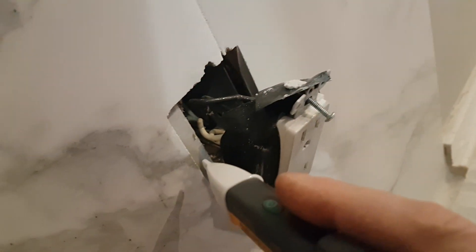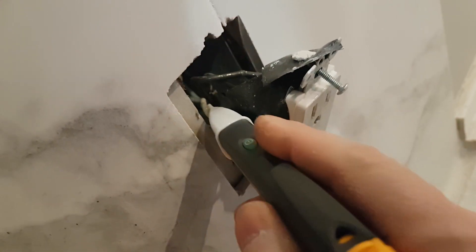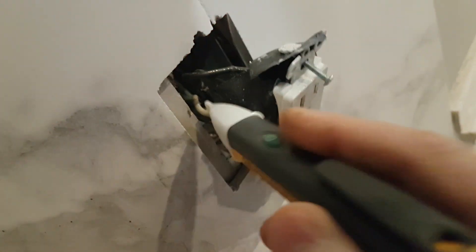Let's try it. These two are neutrals, so there should be no beep. We're basically just running this around the white wire. You see that? There's a little red because it's picking up the black. Now if we go over the black wire, you can see the red light.